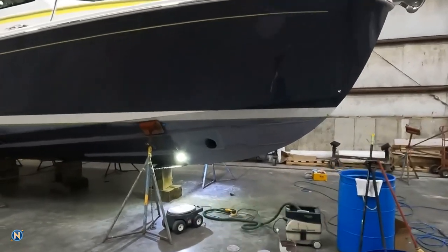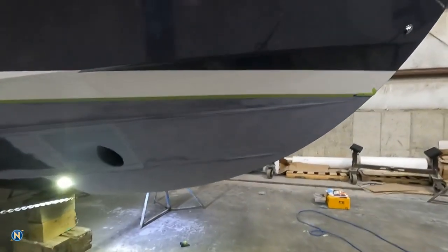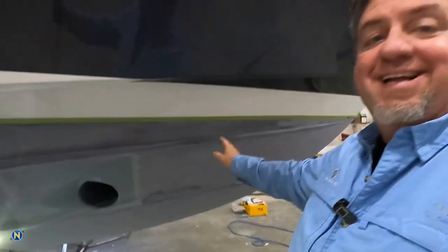Last week we talked about marking the waterline. As you can see, the team is now hard at work getting the bottom prepped. To do a bottom prep job, it's not just sanding — we've got to make sure this whole bottom is completely de-waxed. Otherwise, if you just sand that, you're actually going to sand wax into those sanding grooves and you're going to have paint failure and adhesion problems.